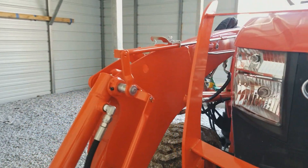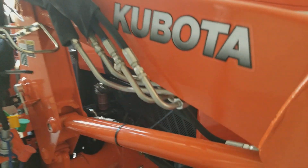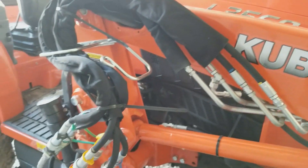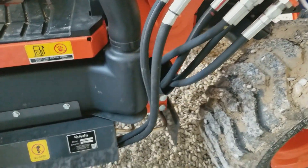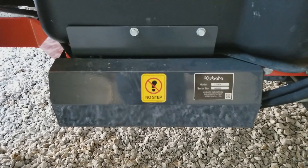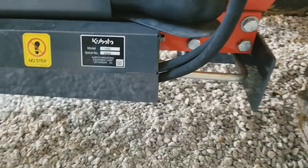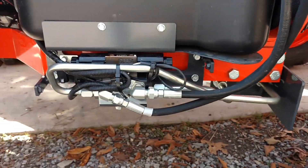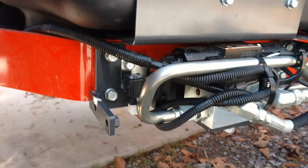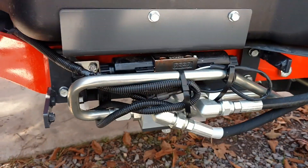Following the lines back, they go into the lever arms just like the rest of the hydraulic lines, and they all pop out right here - they're hard to miss, kind of an eyesore. Following those two hoses with the little green caps all the way down, you get to a part that says 'No Step' - that's actually a guard covering the solenoid valve and relays for the third function. There are two bolts on each side. Pop those off and there's your solenoid - the little black thing with two caps, and the two relays that get actuated by your switch up top.